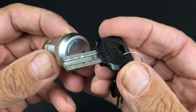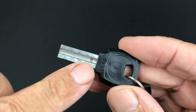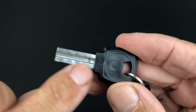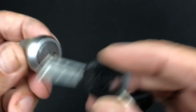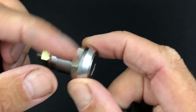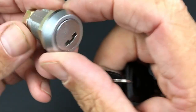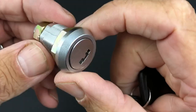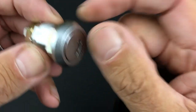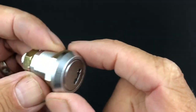If you look at the key itself, you can see there's no bit in there. This lock actually has magnets — four on this side and four on the other side — which interact with some sliders within the lock itself. It only has three sliders, though there are four openings for sliders, so I'm not sure if some versions have four and some have three.